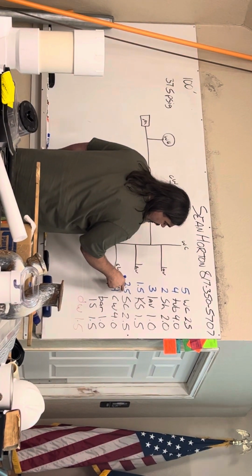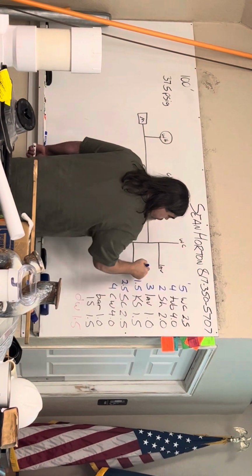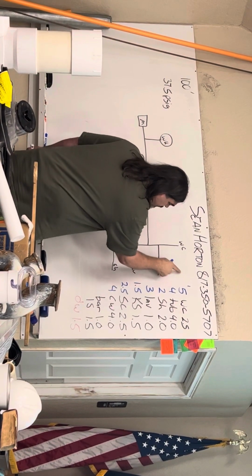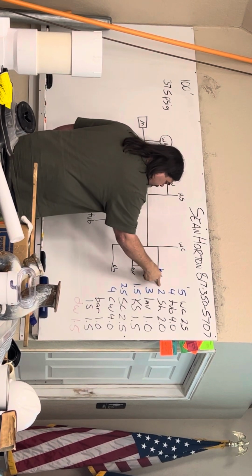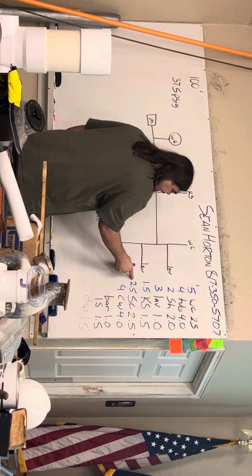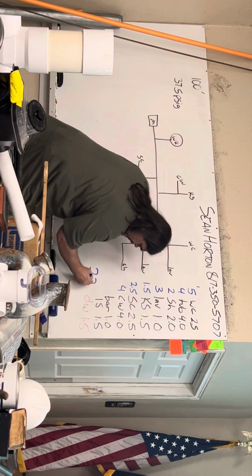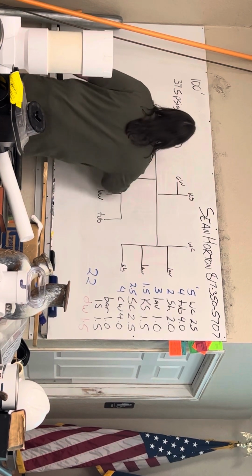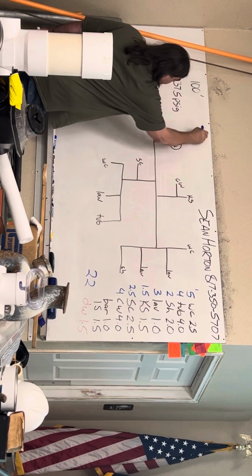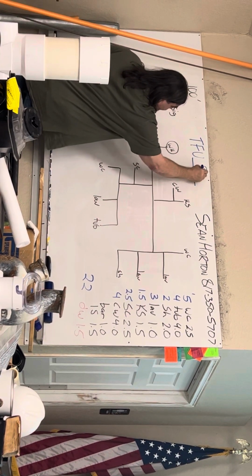I have 2.5s, that's 1. 6, 10, 12, 15, 16, 18, 22. I have a total of 22. So right here, I'm gonna write total fixture units, 22.